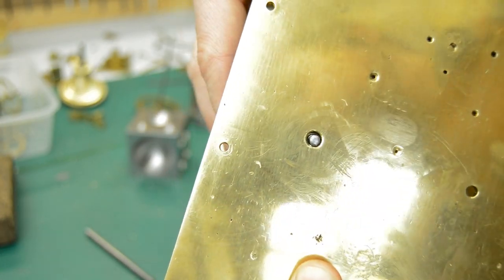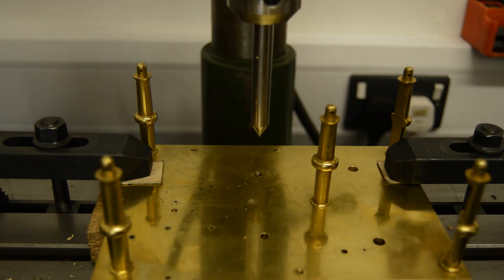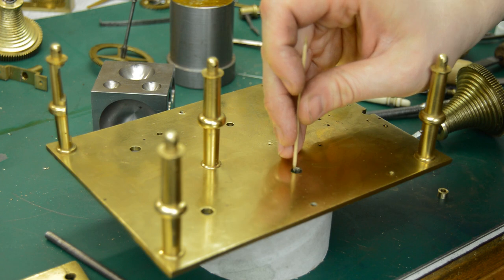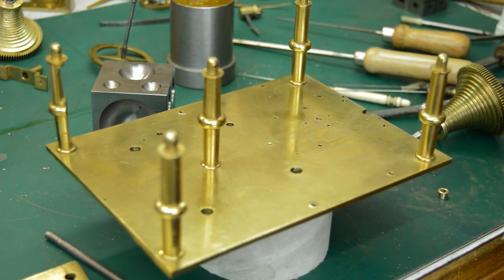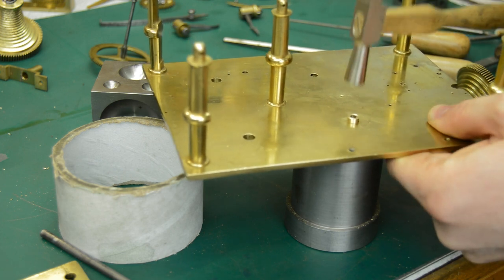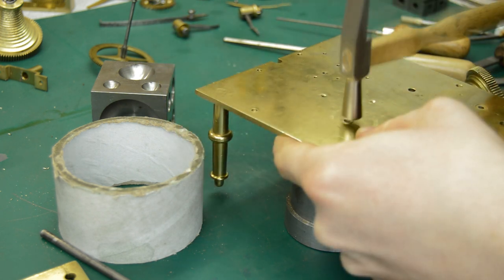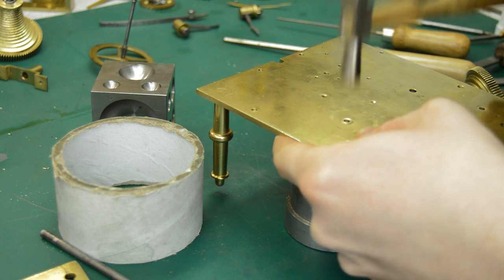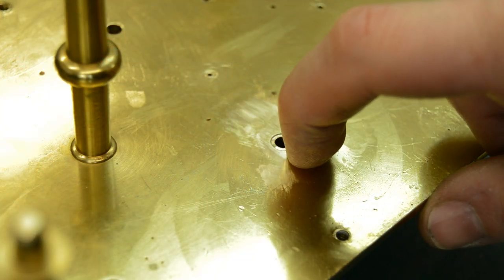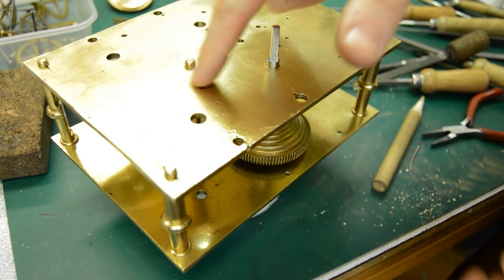With the bush removed, we need to restore the fusee to being standing upright within the plates. Using the same process as before, I've centred the plates and clamped to the table of the milling machine, and drilled out the old threaded section. Then a smear of Loctite and a bushing made from cast brass hammered in and riveted — peened over to work harden it and also to hold it in. I needed to machine a slight recess to get the end shake correct for the fusee, and then I could install the fusee and check it between the plates.